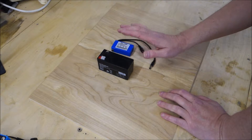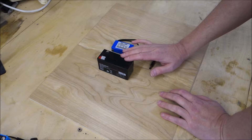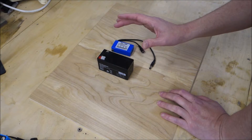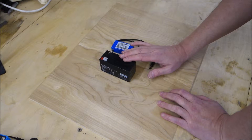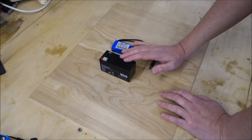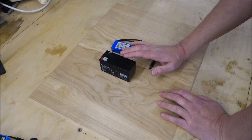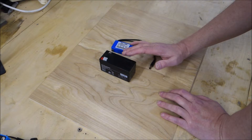I've been told by battery experts that lead-acid battery capacity ratings are generally intended for a 20-hour discharge cycle, meaning the battery is intended to be in use for 20 hours without being recharged. Lead-acid batteries have no overcharge or overload protection, which means you can draw as much current as you like. The problem is that if you draw too much power, not only will they go flat very quickly, but you can damage the battery internally — and if you draw too much, there is a risk of the battery overheating, catching fire, or even exploding.